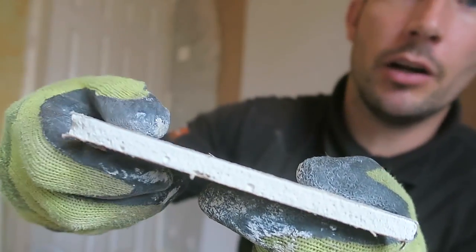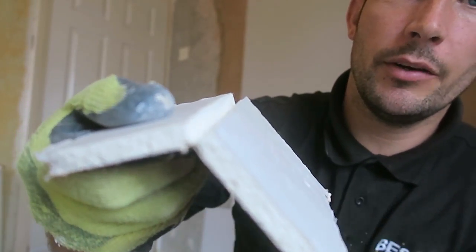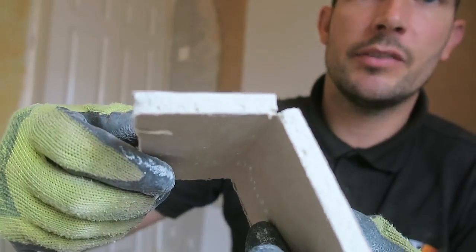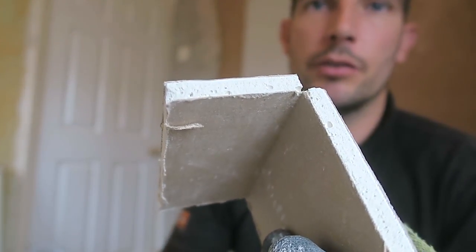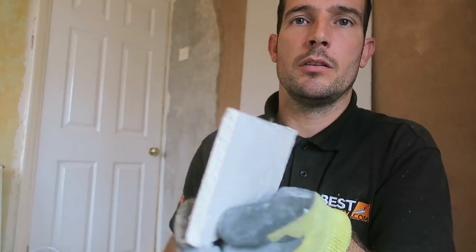So what we can do is put pressure on this side — and that's what we end up with. That's how we cut plasterboard. The back edge we've still got that intact, this edge. This paper still needs cutting away from yourself. Cut from the back, away from yourself.